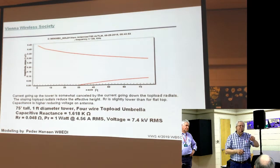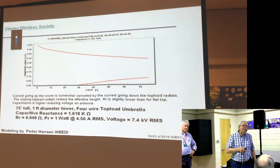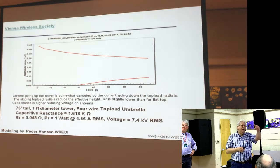If any of you remember the Annapolis site out there, maybe someday we'll talk about that antenna. It used a wire coming right off of the tuning coil up to the antenna, and it was a very long wire, but there was no transmission line. In fact, they used three wires going up there because they had to lower the inductance of that wire that fed the antenna. It actually fed it from the side, an interesting way to do it, but you're absolutely right, a low impedance driver works.